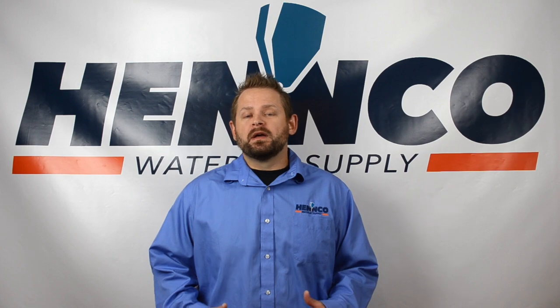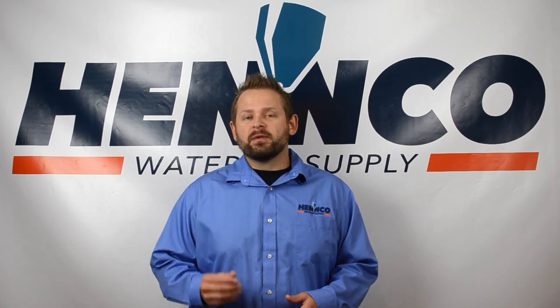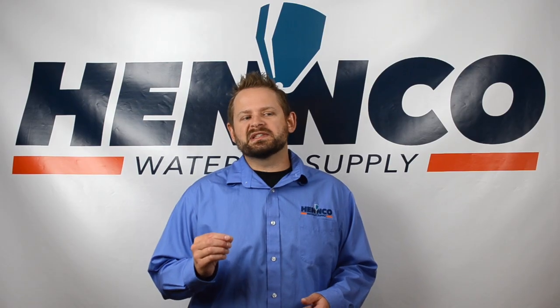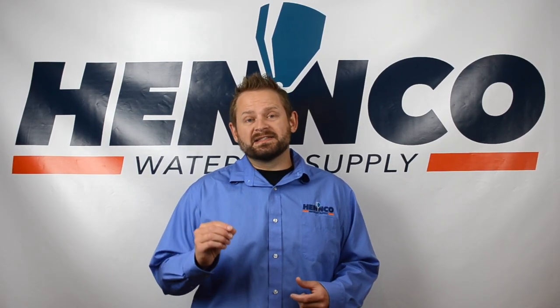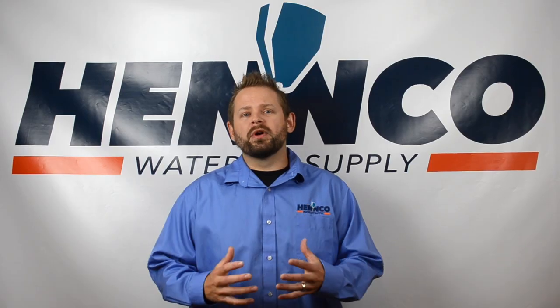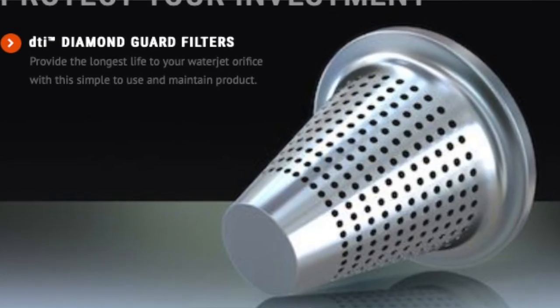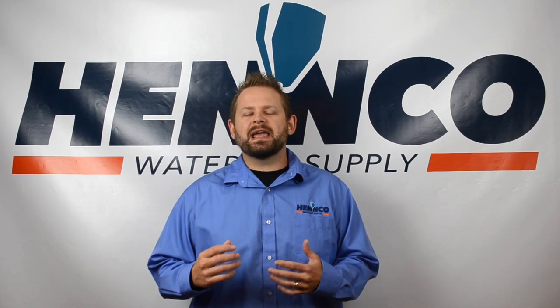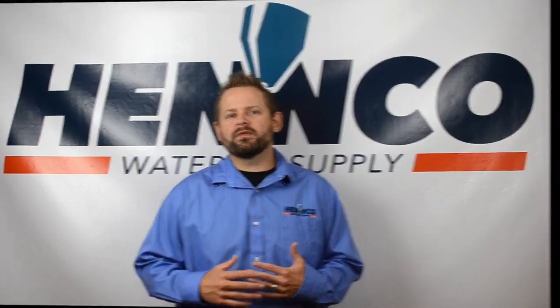What is a thimble filter? A thimble filter is a small high-pressure filter that is installed as close to your orifice assembly as possible. It consists of a plethora of five and a half thousandths diameter holes that are specifically sized to catch any debris that cannot safely pass through your orifice.